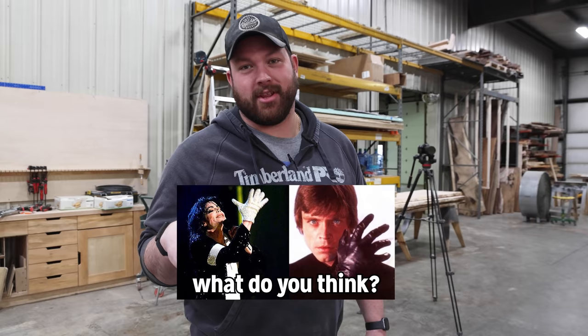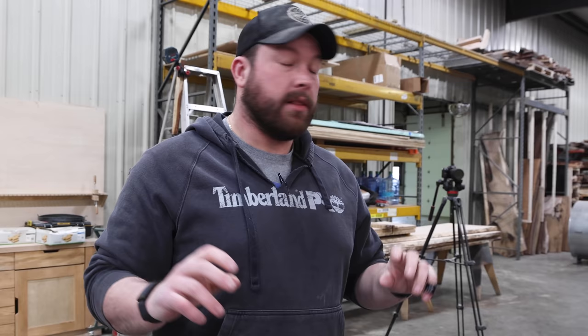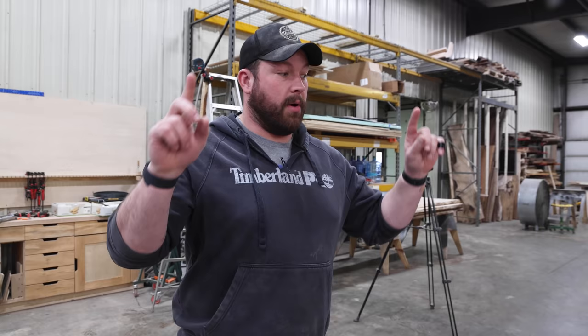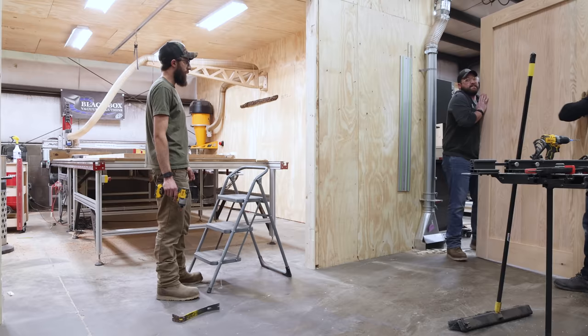Jordan is now the Michael Jackson Luke Skywalker of this shop. The doors are prepped - we couldn't find any more ball bearing hinges in our area so we ordered some more, but for the sake of this video we've got two hinges mortised in both the door and the jamb. We're going to pre-hang these to make sure everything fits before going into final finish and prep, because I want to not deal with fitting issues once we have finish on the door.